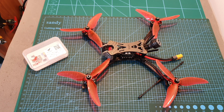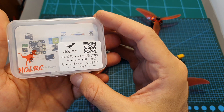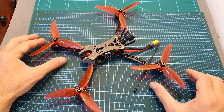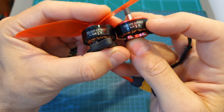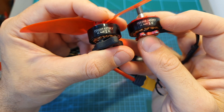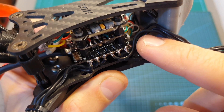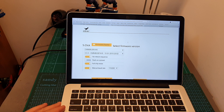Hello guys and welcome back to my channel. Today in this video I'm going to check if the AGLRC FD435 mini stack is capable of handling 6S motors on a 5 inch racer. My testing platform is the AGLRC Wind 5, and basically all I did is replace the original FD 2206 2450KV motors with the FD 2207 1775KV motors, and the original 60 amp 30x30mm stack with the FD435. After installing all the hardware, I updated the firmware of the flight controller to the latest Betaflight 4.1.1 version and configured it.